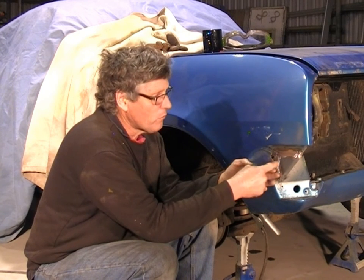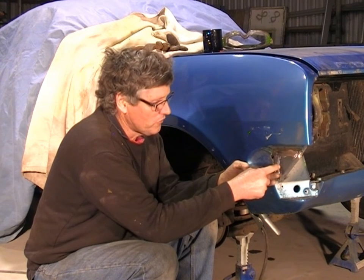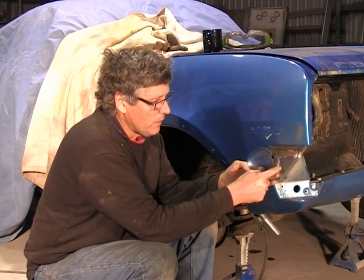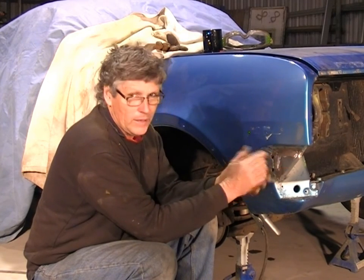And because heat rises, you weld the top bit first. When your weld becomes the hottest, you're welding at the bottom, and you've got that big piece of set weld on the top that's not going to want to run out or fall down or burn the panel away.